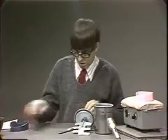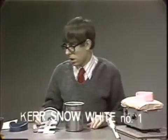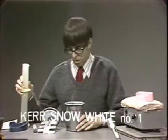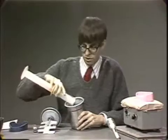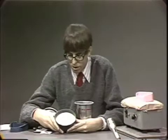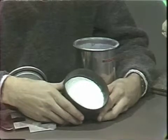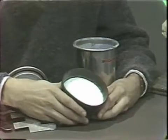I will now make a mix of Snow White Model Plaster No. 1 and demonstrate vacuum mixing of this material. We will first add water to the mixing vessel and I am using 135 cc's of water. And to this I am going to add 300 grams of powder. If you will notice, 300 grams of powder in a normal mixing bowl comes almost to the top, about three-fourths of an inch from the top.